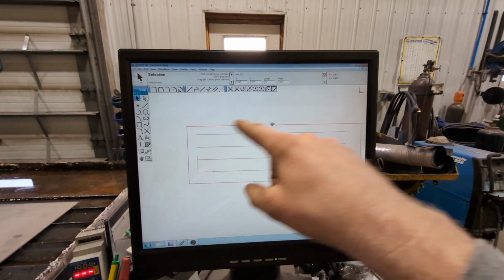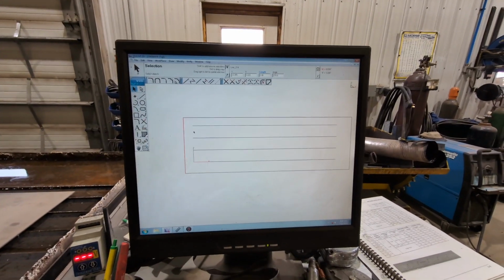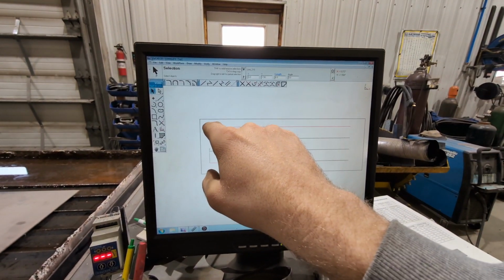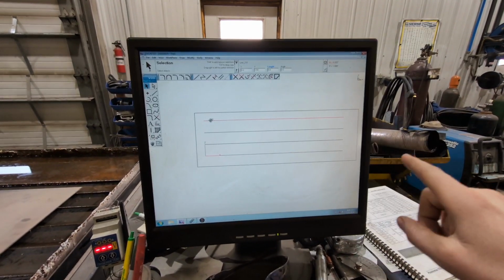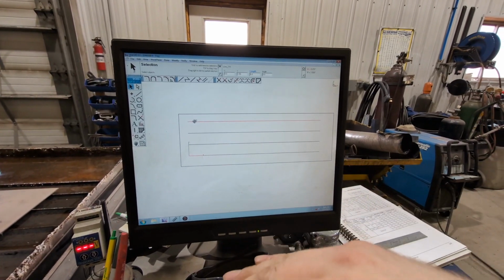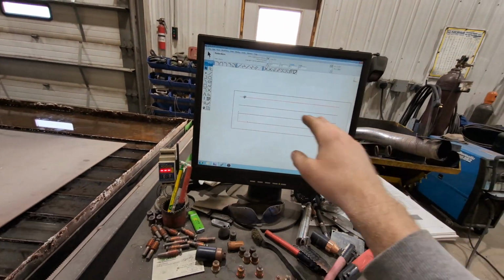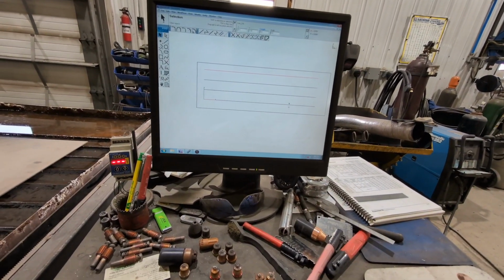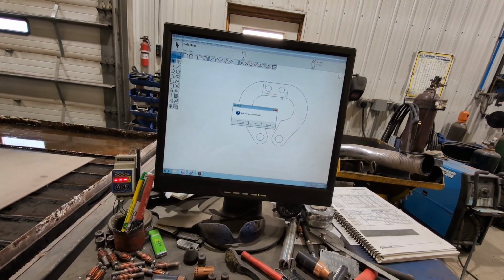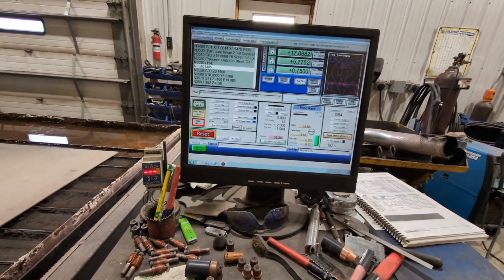This is the one that I use the most. It's got a 7-inch by like 2.5-inch rectangle, and then inside I have 6-inch lines. That gives me enough time to get started, and then that nice straight line is going to get me a nice even arc, and hopefully you got the plate flat enough when you're getting the reading. You'll get a baseline, and then that's gonna be your new setting. Set your voltage to that setting off those lines. This one just has 4 lines on it, but make it however you like. If you guys need anything else, that's how I set the baseline.